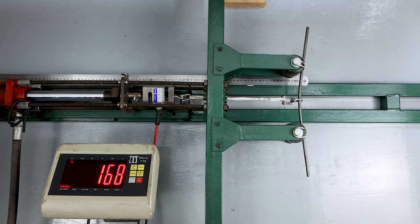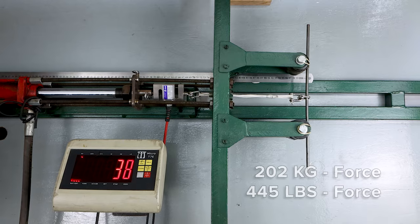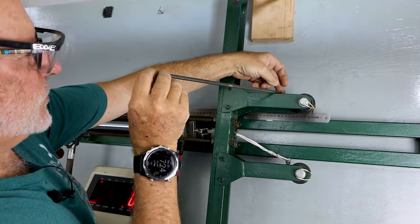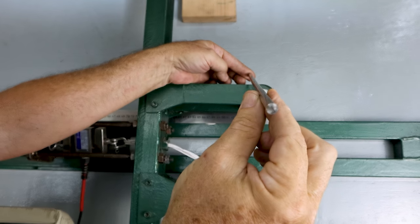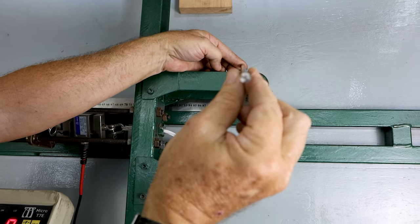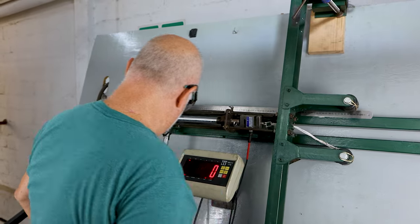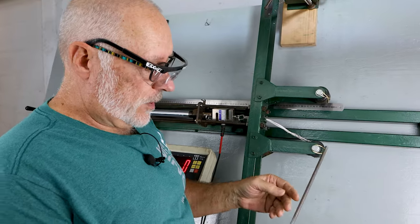The previous one had no holes or notches — if anything it would have just bent, it wouldn't snap. This steel is not brittle, it will just bend in zones where it doesn't have a modification. I put safety glasses on just in case this does fracture, as these could get airborne — it is spring steel wire. We're now at 16 kilos just the start load. There's over 200 — that's impressive! It has taken a very small set, you can hardly see it, but there's an ever so slight bow. It didn't break but it did bend. That took 200 kilos to create the set — the previous one without a hole remained straight at 200.